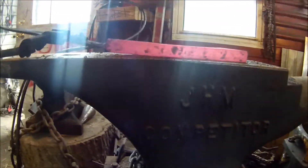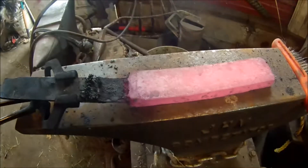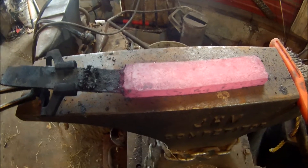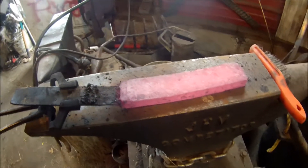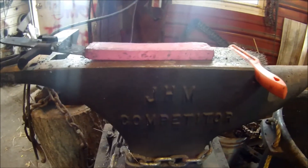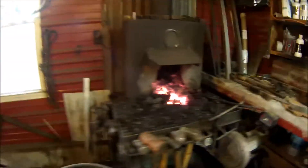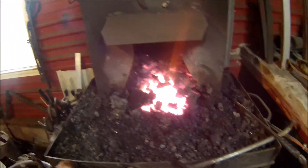Here's my piece — 18 layers now forge welded into one. I'm going to decrease the thickness and the width because I'm going to do a twist on this one. That's always the ultimate test of whether you've got a good forge weld, because when you put these lateral stresses on it, it's real easy to get delamination if you don't have a good weld. This baby's looking good. Got to get some slag out of my forge.